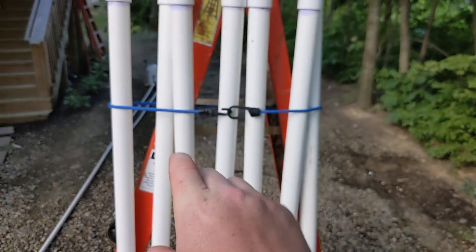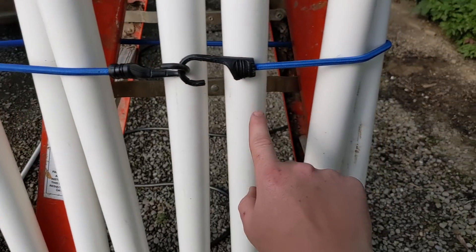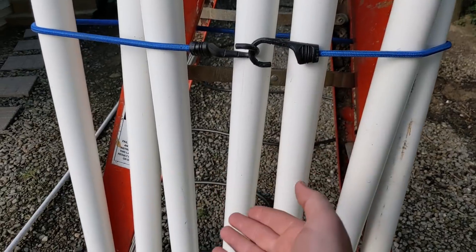Because the column on the downhill side is air. So you have water, air, water, air, water, air, water. All of the water creates back pressure. All of the air can't create back pressure. So the water is being pushed down by gravity.